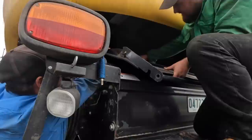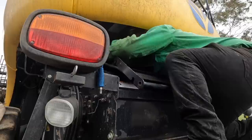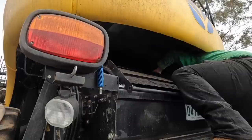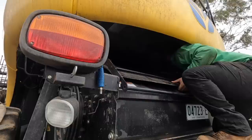On this. So this here is the deflector chute for the stuff that goes into the chopper. So it's a door you can close if you want to stop anything from going through the chopper. And we've just put new rubber bits on the side because it was jamming up with bits and pieces coming out the side. So yeah, it's just basically to adjust how much you want to go through the chopper. Rubber's a bit there, you going? Well, that's the... Do you need me to sit there? Yeah. Yeah, that's all that pushes through a bit more.